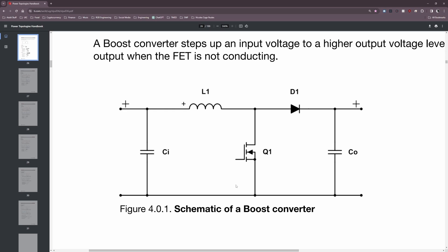One key thing to keep in mind is that with a boost converter, the output voltage is going to be higher than the input voltage. Current flows from a point of higher potential down to lower potential, so if the rectifier diode weren't there, current would flow backwards because the voltage on the output is higher. With the rectifier diode in place, that is prevented since it only allows current to flow in one direction.